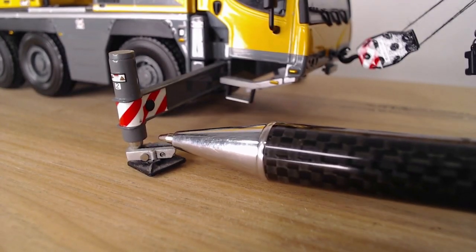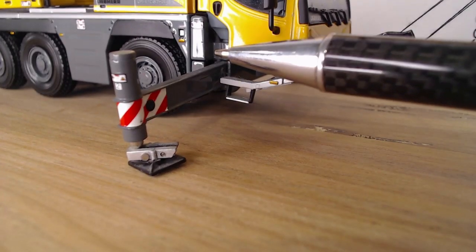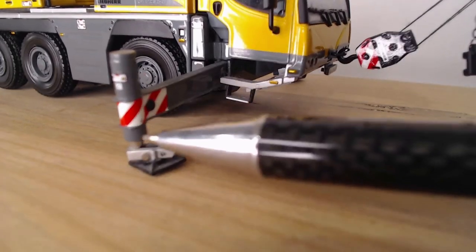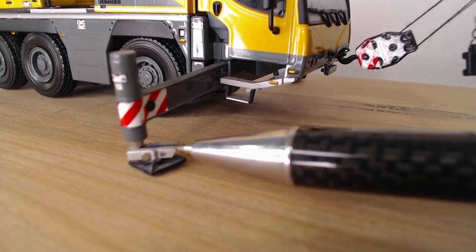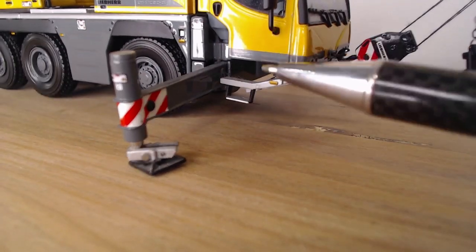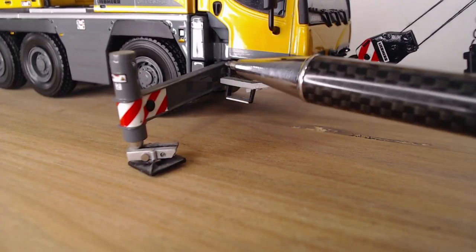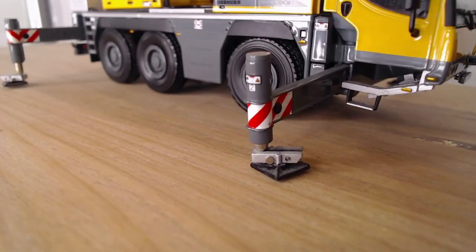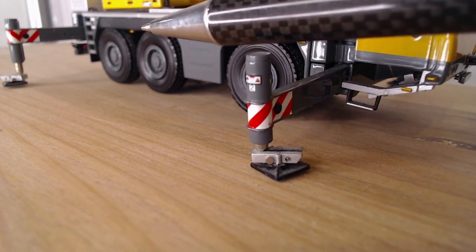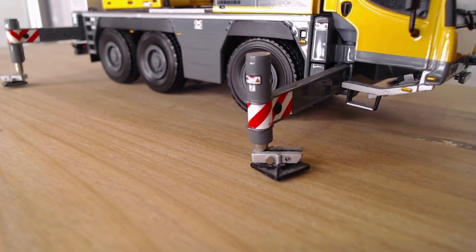I know this is basics, but sometimes riggers just stand there and they don't pull out any pins and they don't slide things, and they put the outrigger timbers underneath this pad when it's not even on the pins. So get out, undo this hook, undo the outrigger pins. Undo that one, undo that one, undo the other side, undo the other side. And that's quick, like five things that you can do so that the crane operator can come around to the side and just punch these outriggers out. And that's handy.